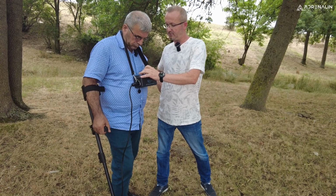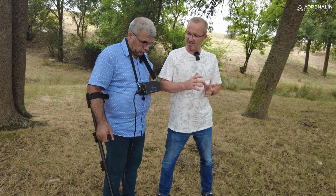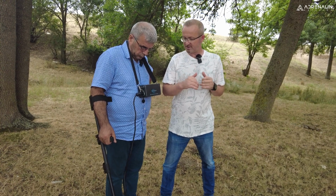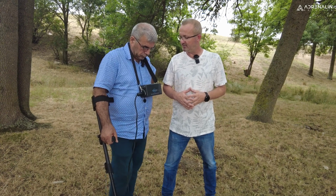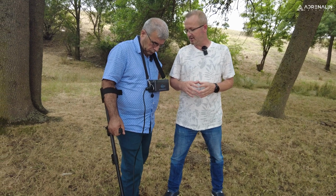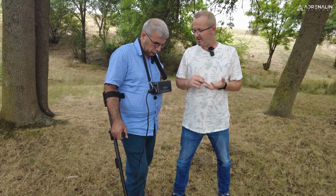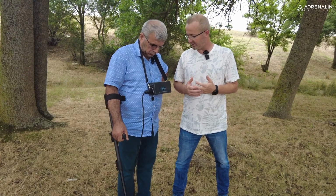The fourth section is labeled mode. It lets you switch search modes. There are 4 modes available. The first mode is the general search mode that allows us to conduct searches comfortably even in electrical environments that provide slow search capability. The second mode is away from electrical environments and has a fast search and deeper search method where even small objects can be detected.